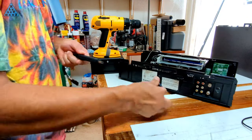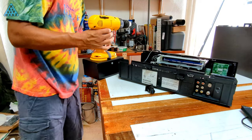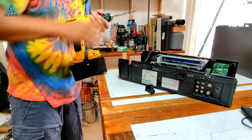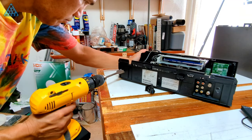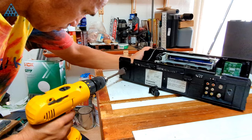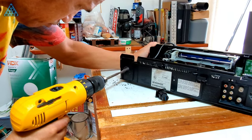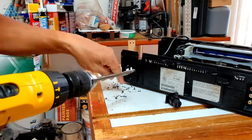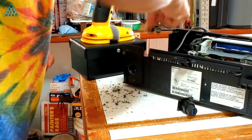The composite cable hasn't come in yet, but I can start mounting the EasyCap using the mountable USB coupler I picked up from Amazon. To drill the hole to fit the coupler through, I'm using a 7/8-inch spade bit. It's a good thing I have a set of spade bits, otherwise I'd have nothing that can drill a hole to that specific size. The tolerances on the coupler between the coupler housing and the mounting holes are really tight, so the 7/8-inch hole has to be exact — any larger and the coupler hole would overlap the mounting hole; any smaller and the coupler housing won't fit through.